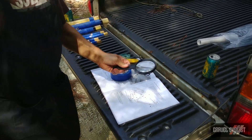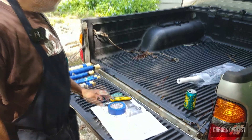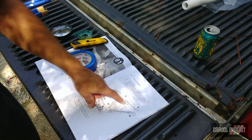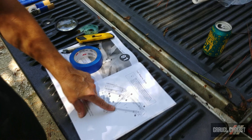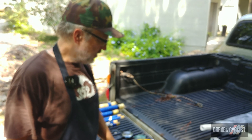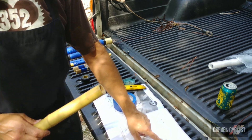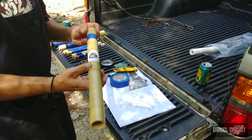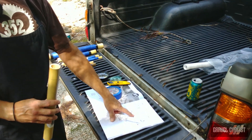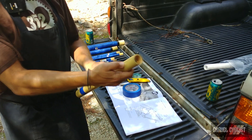If you're like me, not only do you need reading glasses, you might also need a magnifying glass to actually read these numbers. For each tube — there are seven tubes in this kit — each tube has a measurement on this diagram of how much needs to be trimmed at the end to make it fit flush into all the lug pieces. For this process you start with your measuring device and refer to your chart. This is the top tube, labeled by the company, and here we need to go in 45 millimeters from each end — that's what needs to fit inside the lug.